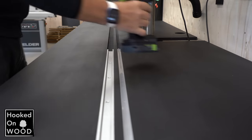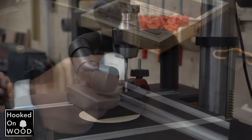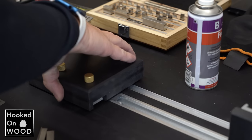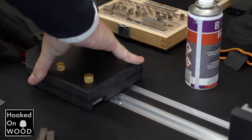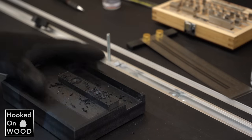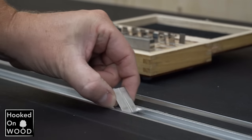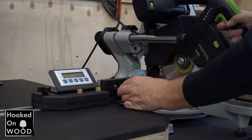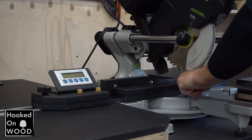When the miter track and LED strips were in place, I could drill the hole to connect my miter stop platform to the miter track. To make the miter stop stable, I made a bar that slides inside the miter track. To attach it to the miter stop base, I first glued it with two drops to make aligning easier, and I used a square to align it perfectly with the miter track. After this I screwed it in place. I did not glue it because I wanted to replace it when needed. There must be almost zero play at the bar, and with my setup blocks this is very easy to do. You can see throughout my video that these setup blocks are very versatile tools. When I found the right size it was straightforward to set up the miter stop, and it was good to see that my digital readout meter also measured the exact distance.